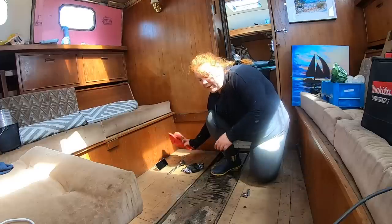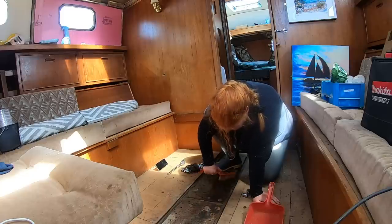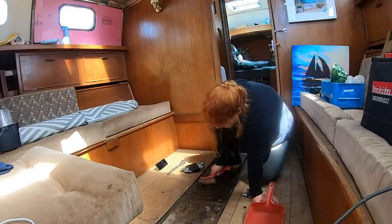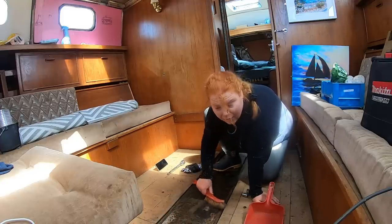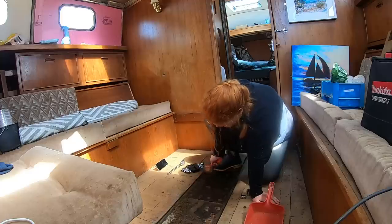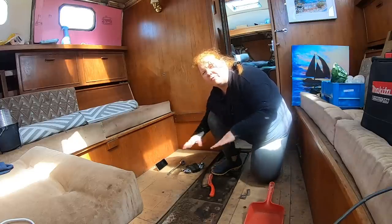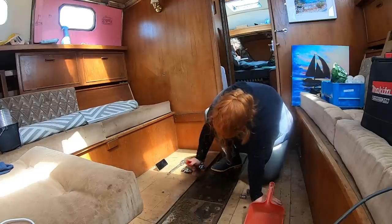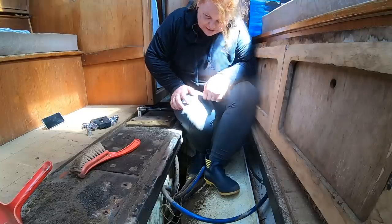So I'm just cleaning up all the sand that's coming through the keel box. The only reason it's come in is because we didn't get all the bolts in and sealed perfectly. Then I'll take all the bolts up, have a look inside the keel box, and start masking off the places I'm not painting for the welding, then get some paint on. They've still got a bit of shot blasting to do on Monday, as there's some new plate we're painting with red oxide just to stop it getting rusty — they've blasted the mill scale off. In hindsight we should have put all the bolts in because there's a lot of cleaning up to do.